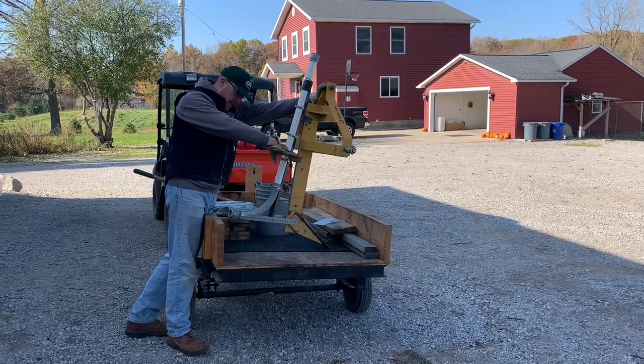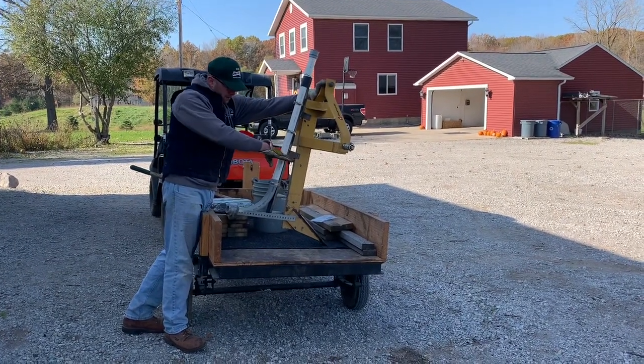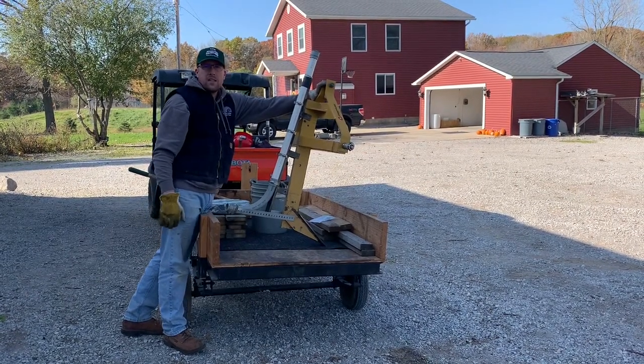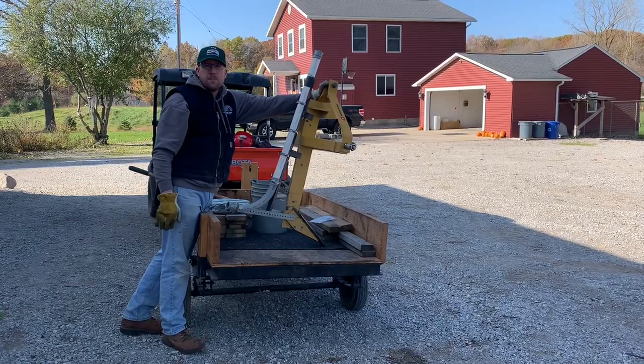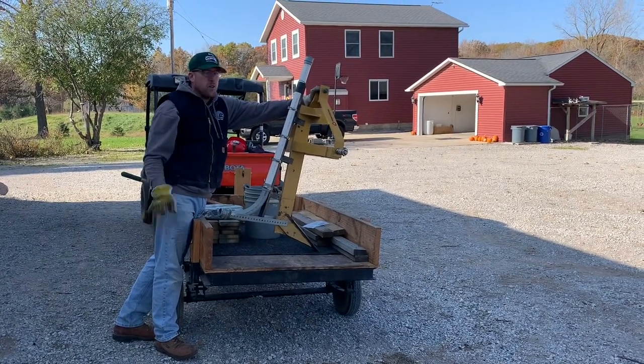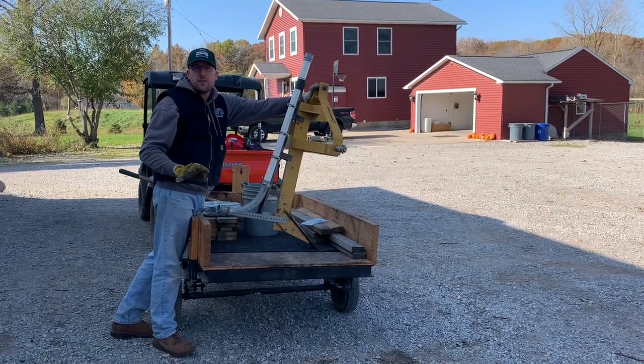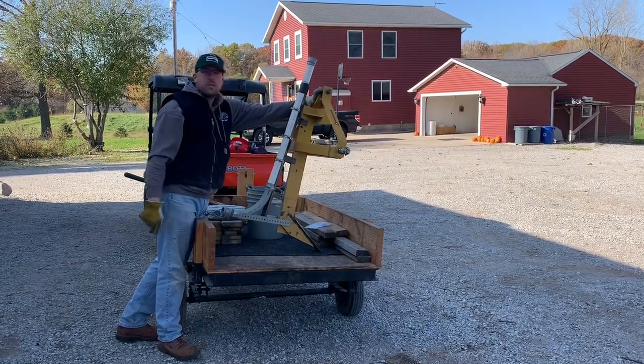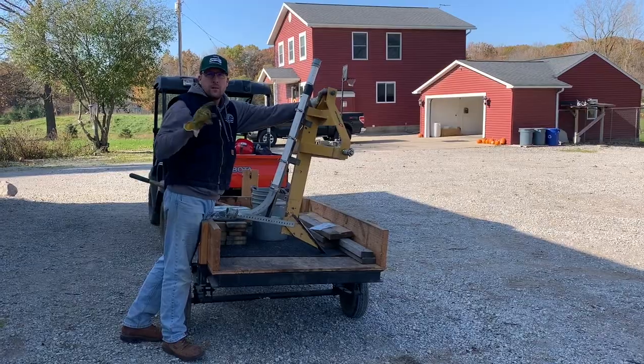And it should be about up to this marker here. It should be about 12 to 18 inches deep, directly buried. And one pass with the tractor, hopefully, if we don't hit tree roots or rocks or anything like that. And we should be done. So, I'm gonna bolt this up and get it on the tractor. We'll get back to you.